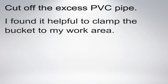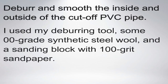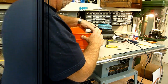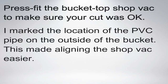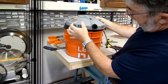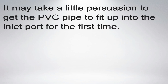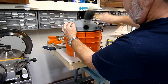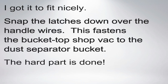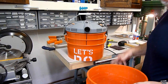You may have noticed that I haven't glued the PVC pipe into the elbow — this was my backup option, which fortunately I didn't have to use. If you measured and cut accurately, everything should fit together now. I marked the outside of the bucket at the PVC pipe — this made it easier to align the inlet port with the pipe. Ever notice how two nested buckets are hard to get apart? My design depends on that.